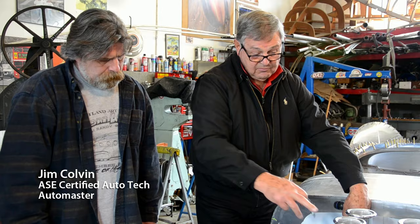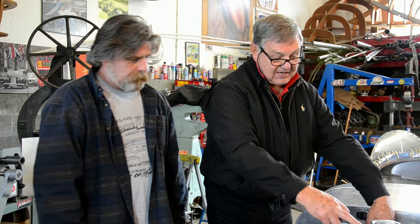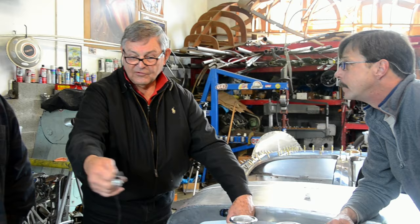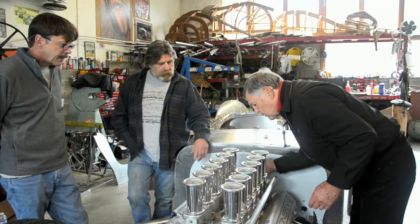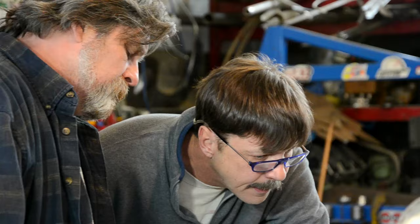This is kind of unique because it's going to be outside and not inside. So it's going to be sucking actually air temp from outside. So this could actually go in front of the radiator or anywhere where it picks up the ambient temperature. Yeah, not underhood temperature. If these were underhood, we'd want to be underhood. Right. What is the pressure setting on this thing? I think it's 60. About 60 pounds. 60, 65, somewhere in there. And this is your oil pressure. That's oil pressure right there.